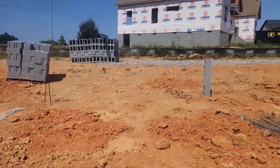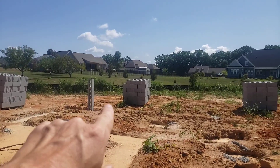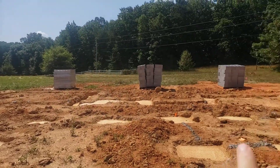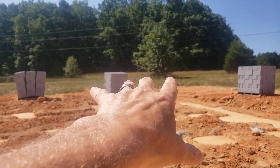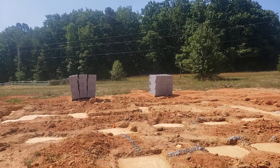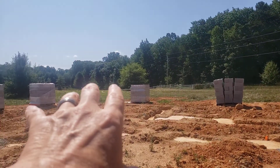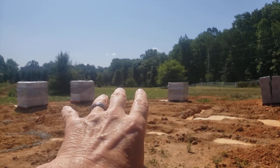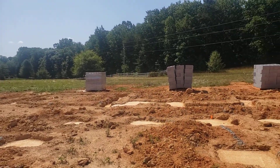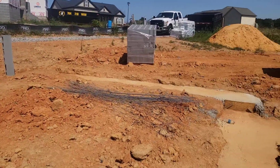What makes this lot unique is the way this house is situated — it's almost down in a hole. There's one low spot where the water drainage would go. Typically we'd like to put the house up on the higher part of the lot, but that was the only place we could fit a septic system. You see all those colored flags? That's where the septic system is, so that area was basically off limits. We couldn't put the house any further up, and it really wasn't practical to put it downhill either — we would have to have a pump septic system and a much larger driveway, which would add to the expense. So this was the only place we could really put the house.